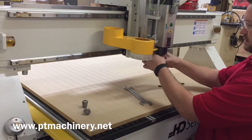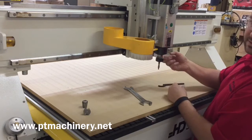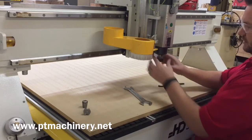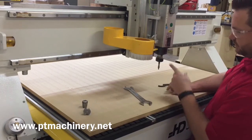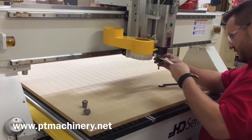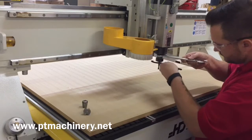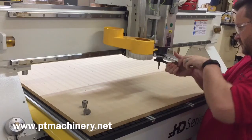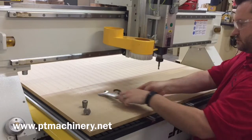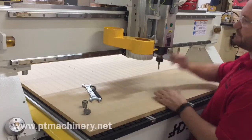Get that snug — don't want to over-stuff the collet. Make sure that there's none of the cutting edge inside the collet; about three-quarters of the shank is good to have inside. We also don't want to bottom that out in the spindle, so this is a pretty good setup right here. Now I'm just going to tighten this up, and that's all there is to it. Got a new tool in there, it's tightened up.